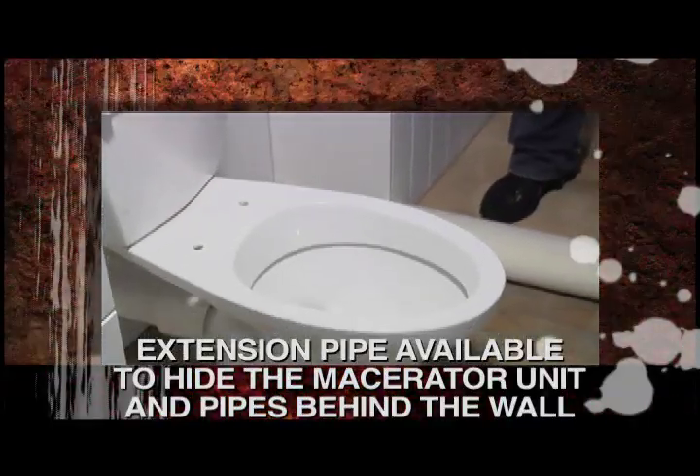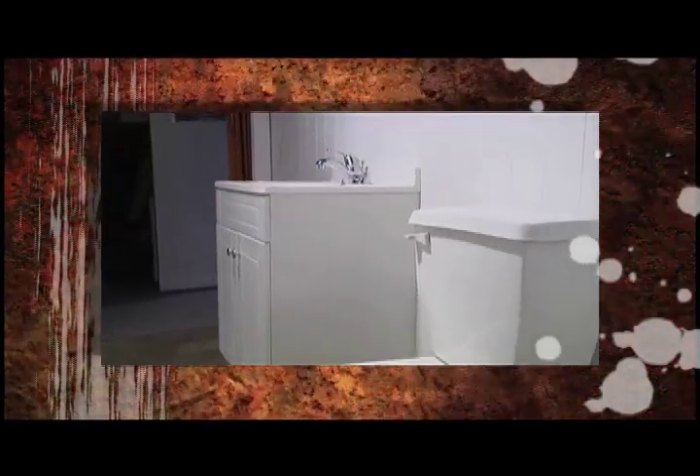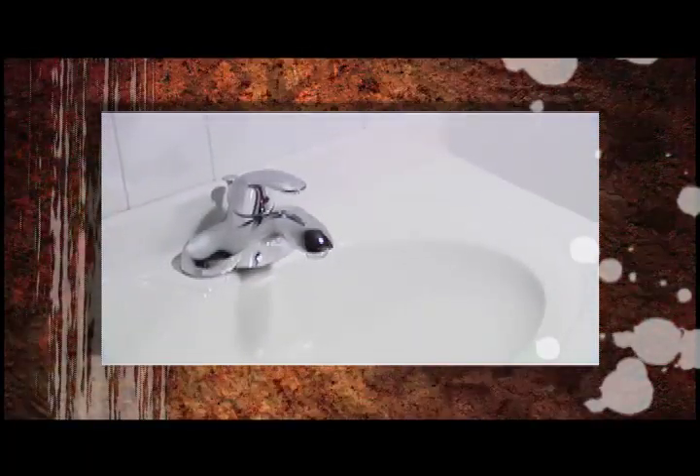This is pretty much what the finished product will look like, and it's just clean. The only pipe is coming out from the back of the toilet and going on to the other side where Ed's doing his work. There are little finishing touches left — some bottom molding, mirror, light bar, and some electrical work that Chaz is going to be doing for us later, and the bathroom will be finished. The electrical work will be for both the bathroom utilities and the pump itself. We're going to have a GFI protected outlet for the pump, and also a GFI protected outlet for the sink area in case somebody wants to plug a hairdryer in. Then there'll be a switch on the far wall with a light bar above the sink.